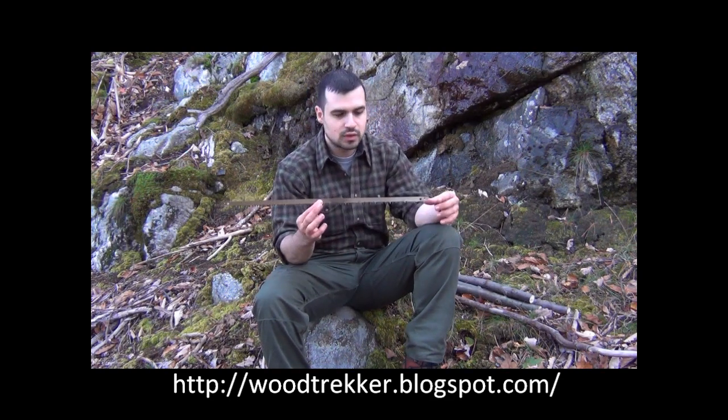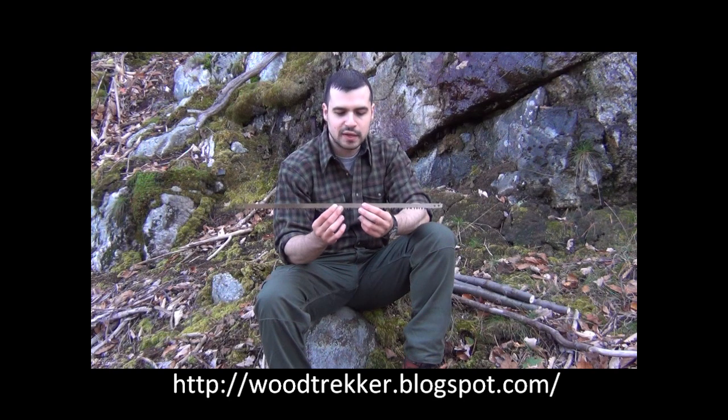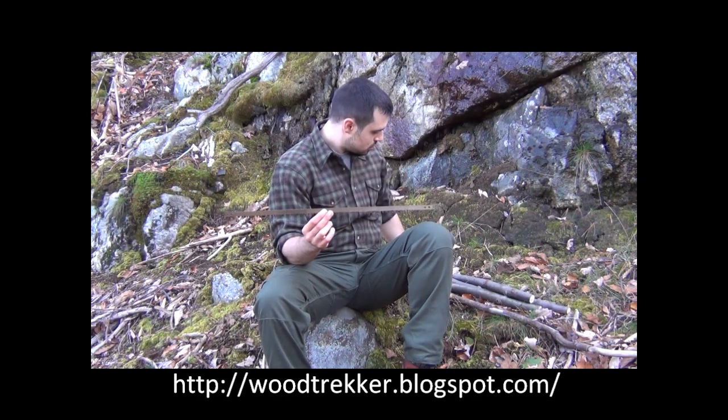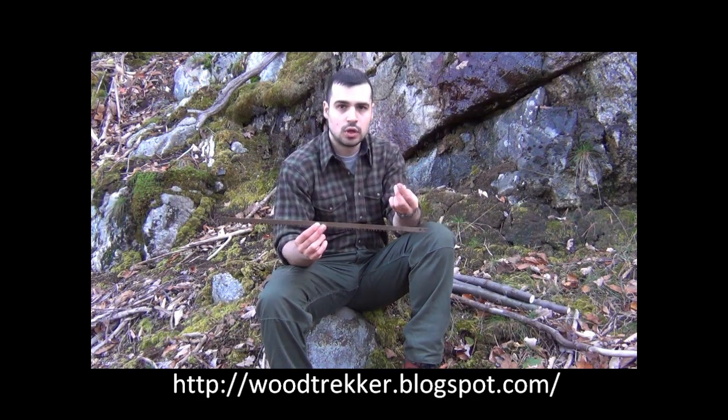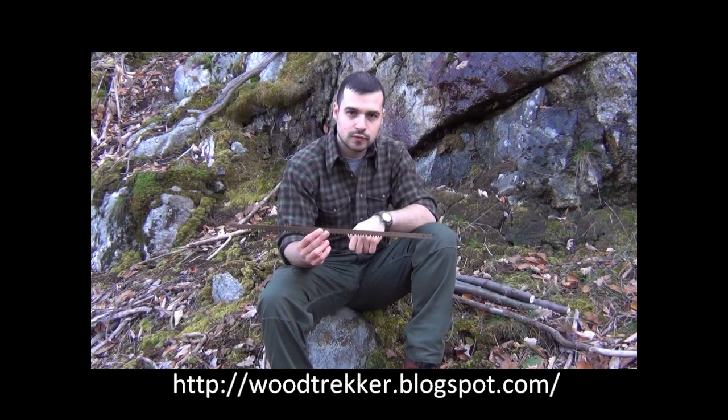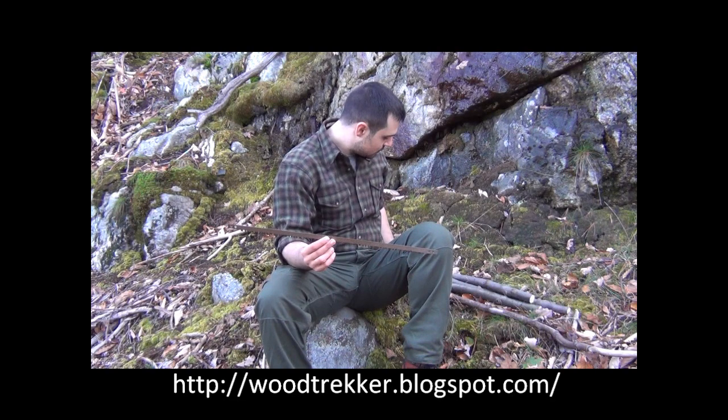In this video, I'm going to show you how to make a buck saw out in the woods. But the materials you're going to need are, of course, a saw blade. This one is a 24-inch blade. You can see some blades actually come with a cap or a protrusion at the end, which can hold them in place. Since this one doesn't and instead has holes, we're going to use two bolts to thread to each of the holes. So we'll also need that.